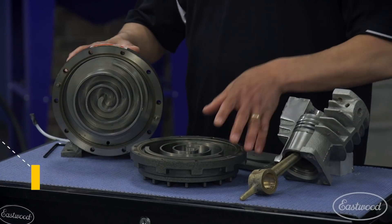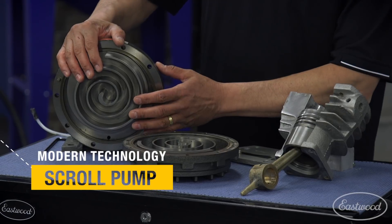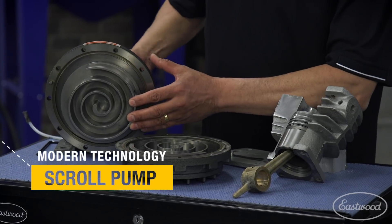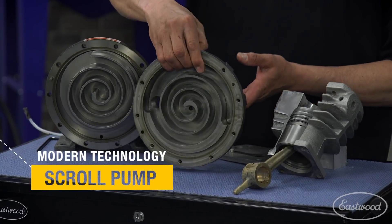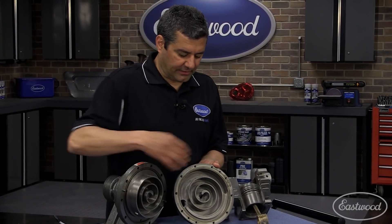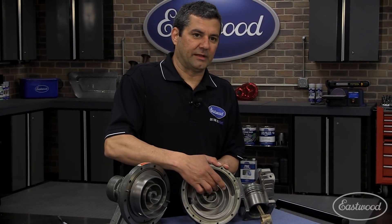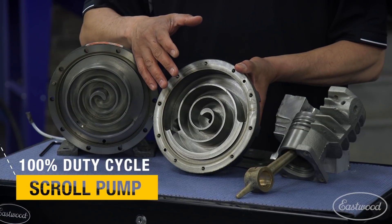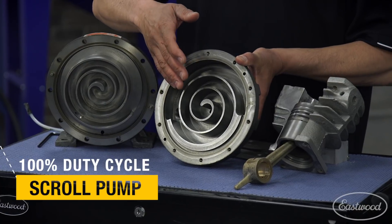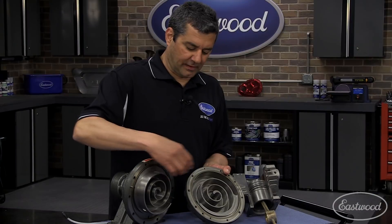This is a scroll. This is the innovative technology that's come out of that, as Randy was saying. So you have basically one moving part. I'll turn the crankshaft here — this is going to move in this elliptical pattern. This is your stator, and this is connected like this. So your rotating section here is turning inside your stator, pulling air in and compressing it as it goes around to the center here and out. So this is 100% efficient in here, and the reason is because it's moving in one direction constantly and efficiently. These pieces never touch here — there's a small couple thousandths tolerance between the two.